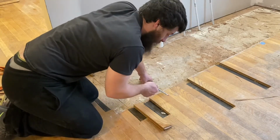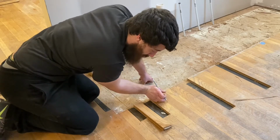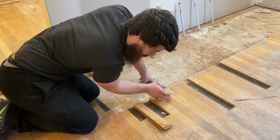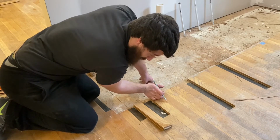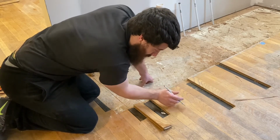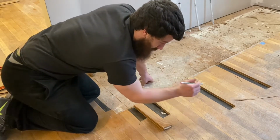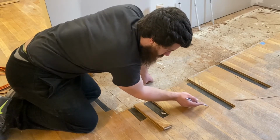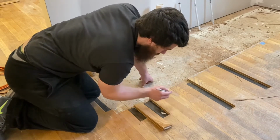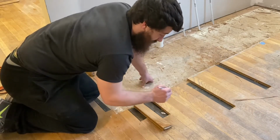So I like to stair step it that way. Another reason is because of the multi-tool, you can't touch this board here. You're going to be able to see, oh, he cut over into that board. So this is the only one I really have to focus on because this board's getting cut back to here, so the multi-tool can drop into there. It doesn't matter. But I have to make sure this one's right. These two can be kind of sloppy, just as long as it's straight. You can eat over into that. So I like to stair step back.